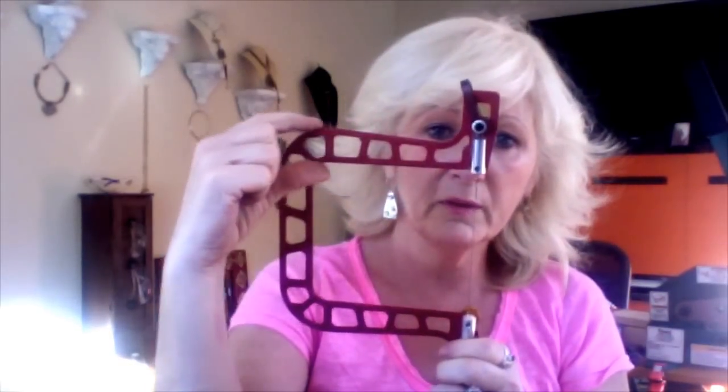So if you're working on bracelet shanks or big, huge pendants or something, it can be beneficial to have a bigger circumference here. And all that means is when it says 5-inch saw or 3-inch saw, this part will either be 5 inches long or 3 inches. This is a 5-inch saw, I believe. There's 5 inches between the blade and the back. So if you're sawing, you have 5-inch clearance. And this one is also a 5-inch. But they do come in 3-inch, so you can choose which one works best for you. Obviously, the smaller the saw, the more affordable it would be.